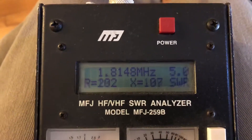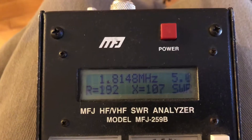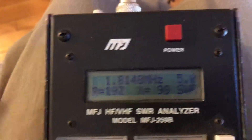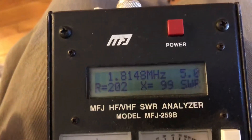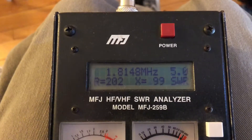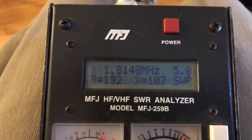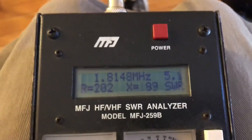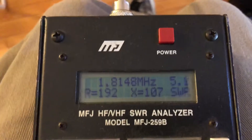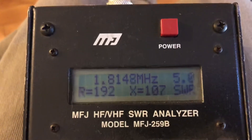What I did was go to the other side of the antenna and install about a 50-pound spring in line with the Dacron rope, so there's some pressure on it. That straightened it out and changed the antenna a little bit for the better — there's a lot more bandwidth. I have about 50 feet of RG213 coax and just a small amount of RG58 going from the wall to my radio. I also added a one-to-one current balun at the feed point of the antenna.